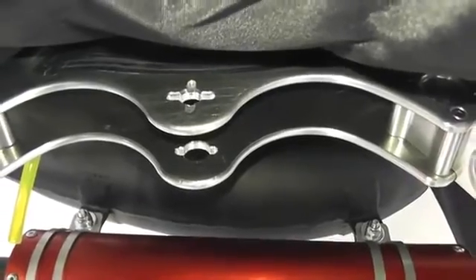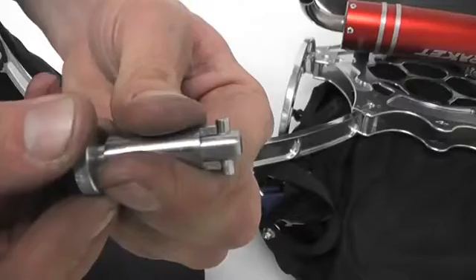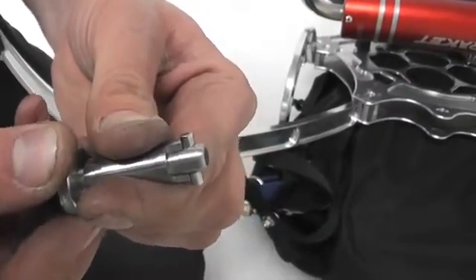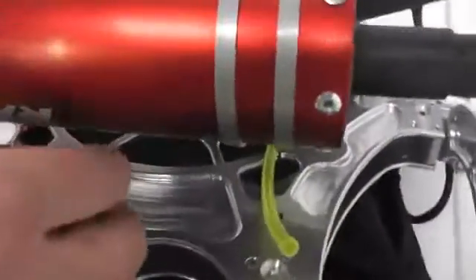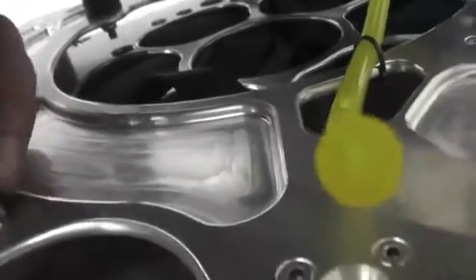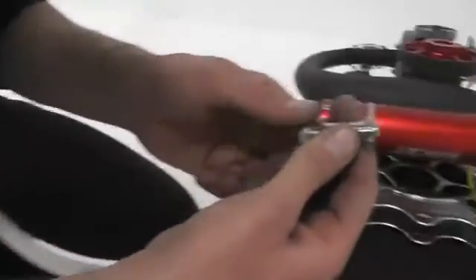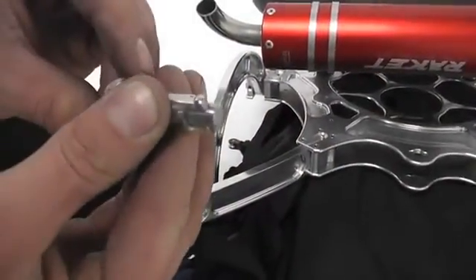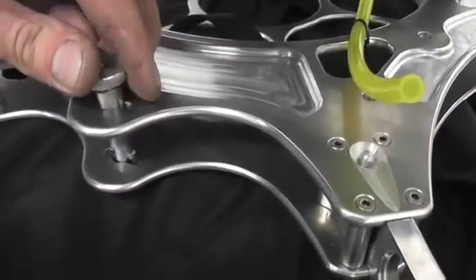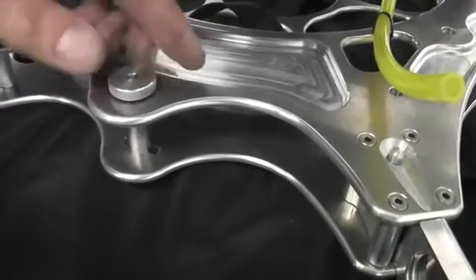Now we're going to look at how we actually attach the fuel tank. Here are the fuel tank holes — one side has a cross, the other has the hole. Now we can see the retaining pin. You can see it in the right position there, and that's going to be pushed through to the retaining position. But in the retaining position it can't actually be pushed down through the hole. So we'll take it out and put it into the correct position for pushing it through, which is sitting on the two arms. You push it through, all the way through — push hard, turn and twist, and it sits into the cross. So it's retained positively.